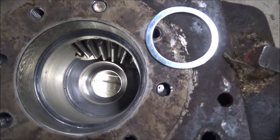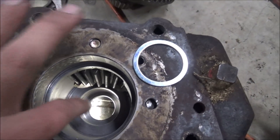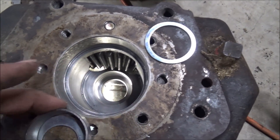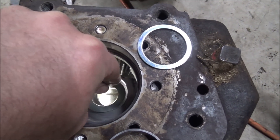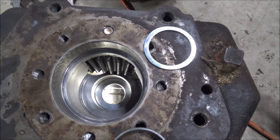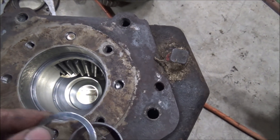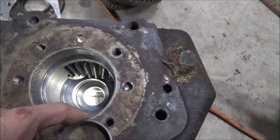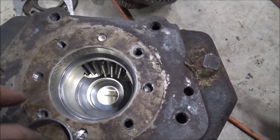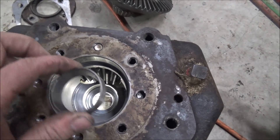I didn't have to open that hole any larger than necessary and make it any weaker, since that's the weak point on this side. Where it's thin over there, it gives us some more meat to hold so it doesn't blow the side out. In order to be able to get the race out, I'm using a washer that'll catch the race — it's smaller than the hole so it gives you a ledge to tap on to knock the race out. The end of the cage needs relief because it sticks through the back a little bit, so I've got a washer here that matches the race so it's got clearance for the cage, and I've bored it out extra deep to allow that. So I'm gonna knock this in and I'll bring you back.